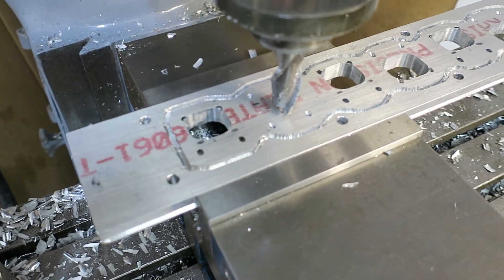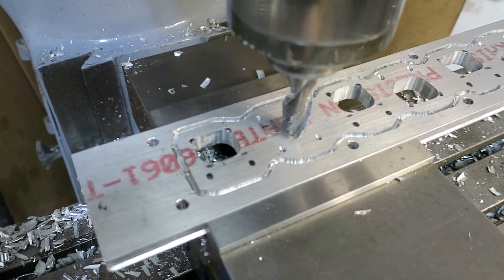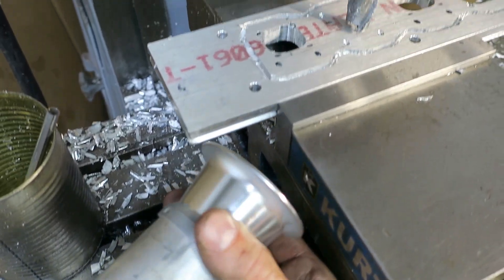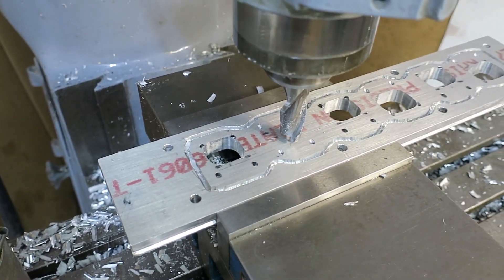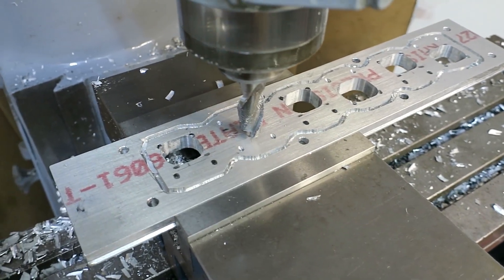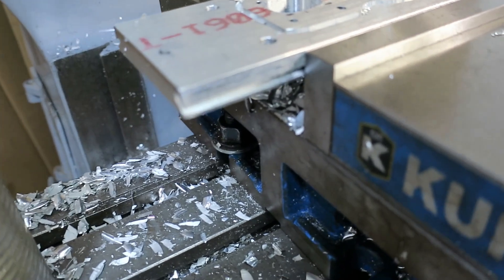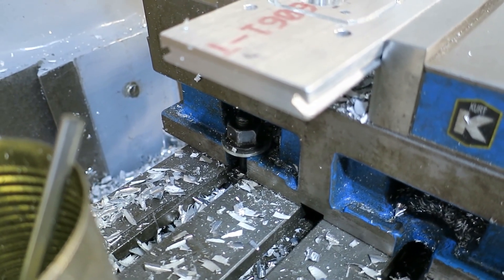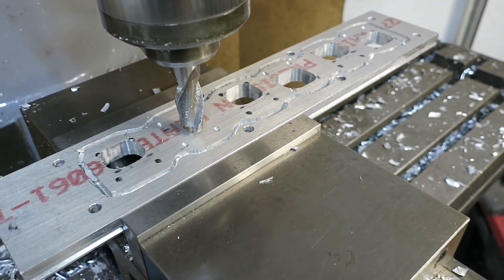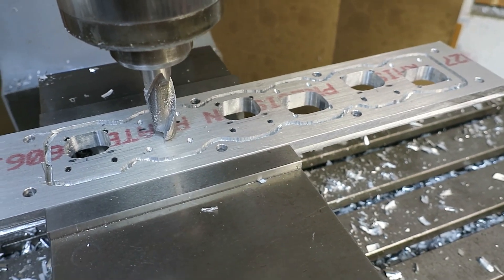I made the base plate a little extra thick because I need to blend the shape of the port. I've got these stacks to be welded onto the base plate, and I've got to contour the port so that they match the ports in the head. The base plate is half-inch thick. I cut a rabbit groove in the ends — that'll be for the sidewalls — so the plenum has a little extra support and it's not just relying on the weld under pressure.